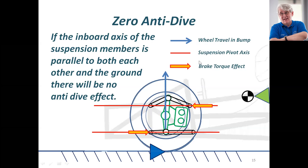I'm assuming that the good drivers here will all trail brake — meaning they don't just do all their braking in a straight line, but actually brake when turning into the apex of a corner. If you're not doing that, you're not going fast. The problem is that as you turn the steering wheel, the caster and KPI effect multiplied by the scrub radius means one front wheel is going to get light and probably start to lock up. That's why I'm cautious about introducing geometrical anti-dive into the front of the car.